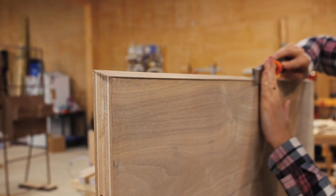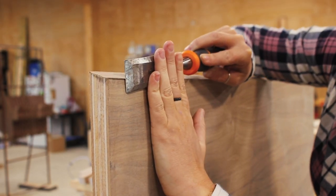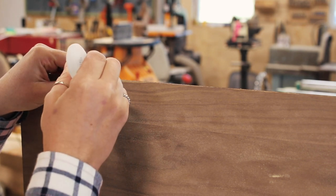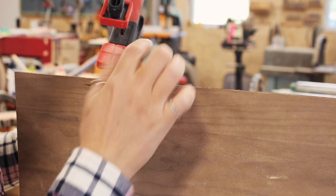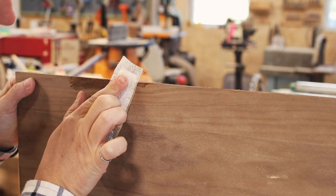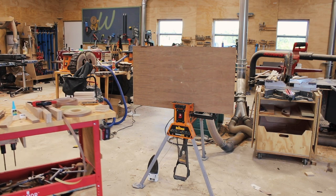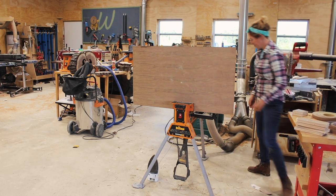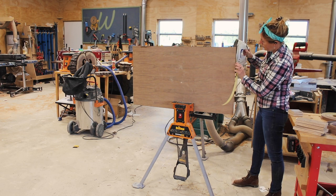Rockler actually makes a tool for this task but I couldn't find mine so I used a chisel instead. If you go this route you just want to make sure to keep it flat or it can dig into the veneer as I did here. No worries though — there are solutions to all of the problems. To fix this I grabbed some DAP Rapid Fuse which only has a 30-second set time and sticks to just about anything. A tip: I use a piece of tape on the end of my finger to press into the glue — this way I don't get my finger all glued up. I recommend making yourself comfortable as it does take a second to cover so many parts. I typically use my armor workbench as a workstation that can move from side to side on the larger pieces like the tops.